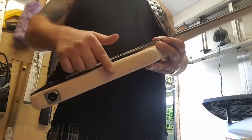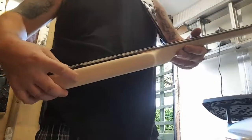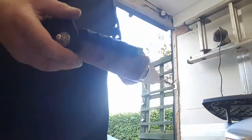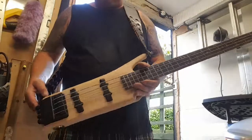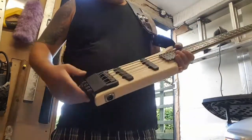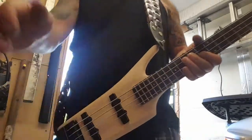I might get one of those, because I know I can get them to screw straight on, which will also cover up my little dodgy bit. But then again, I've got another dodgy bit I need to fill in. Anyway, what I'm going to do now is strip it all, fill in my hole for the dowel. I'm going to fill all of the screw holes on it with sawdust and wood glue and let it go off overnight,